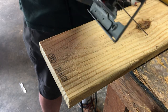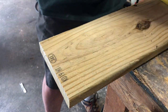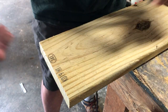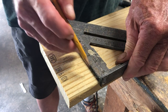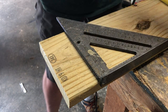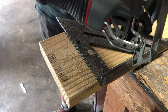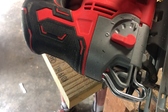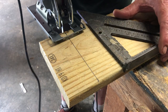Basically the same way you do with a circular saw — you use your speed square. Here's the basic procedure: first, mark where you want your cut to be. Then make sure the orbital setting is turned off, which gives you your cleanest cut. That setting is right there. Then you simply line up on your mark.